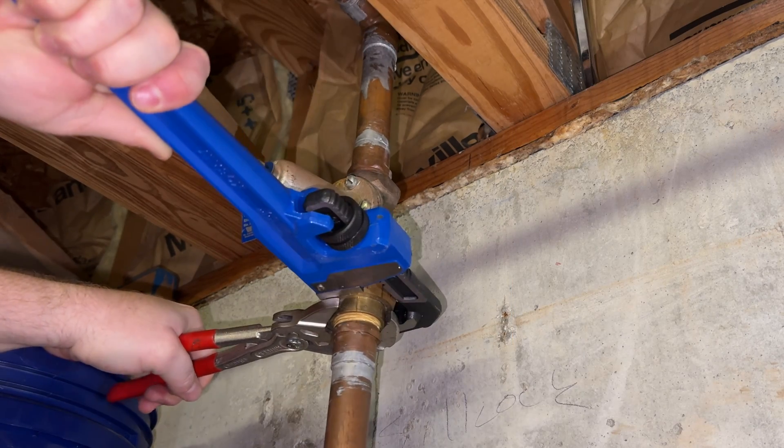To me, how a pressure reducing valve works is a genius engineering design. All of the water going to your house gets filtered through this screen right here — this catches any debris coming from the city side. If you take the screen off, you have this plunger-looking thing that's spring loaded. This is the part that actually seats and cuts off with this O-ring water upstream when it reaches the correct psi. This rubber O-ring sits on the metal seat like so, and this tension is spring loaded by this spring right here.